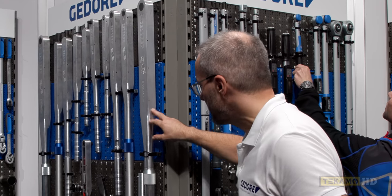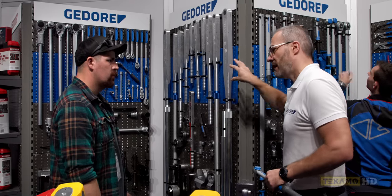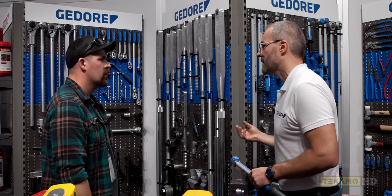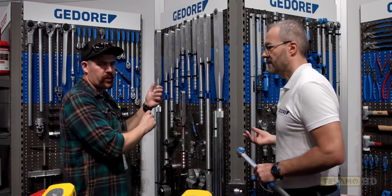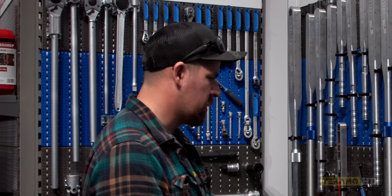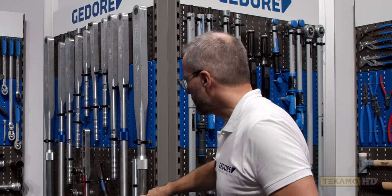The point you raise — this one is also working with the spring, but you don't have to reset it immediately after you've tightened your screw. It's important that you do it after a time. So you still zero it — you zero your torque wrench back when you're done for the day. That's a basic thing. Anybody turning a wrench should be taking care of their tool. You should be zeroing your torque wrench anyways, with the exception being the split beams. A lot of guys leave them preset.